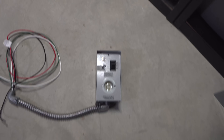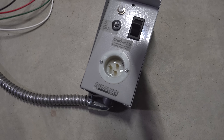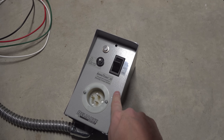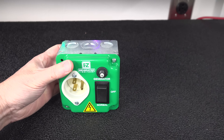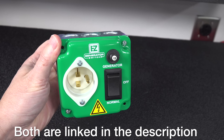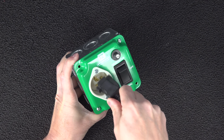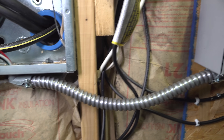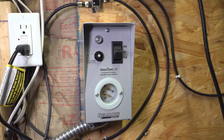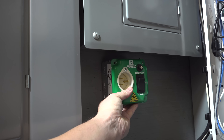The switch we're installing is made by Reliance. It's a single outlet 120-volt circuit that's going to run most people's heating systems, or other circuits like refrigerators or a microwave. Reliance isn't the only company that makes these — this one is called Easy Generator Switch, priced about the same and works just as well. The main difference is the Reliance includes a cabled pigtail, meaning you can mount the switch about a foot away from your electrical panel. Because my friend's panel is recessed and there wasn't much room to work, we're going to use the Reliance for this install.